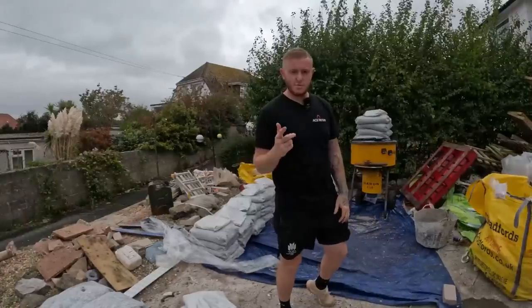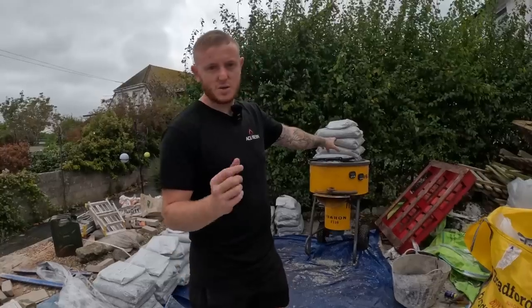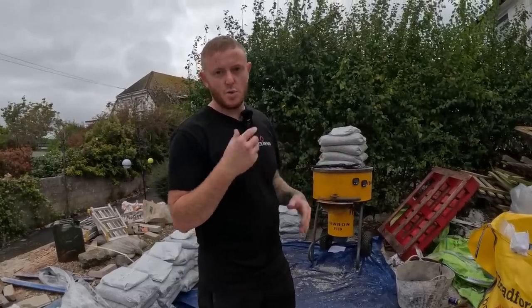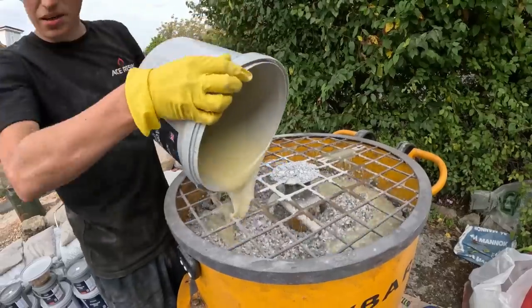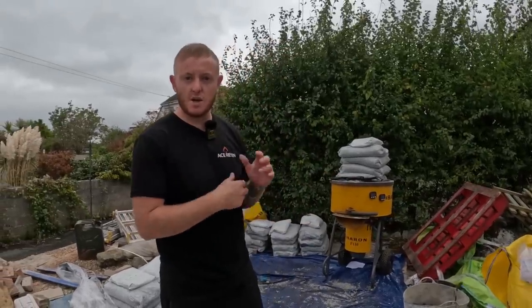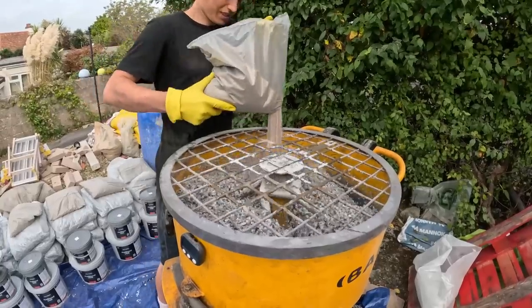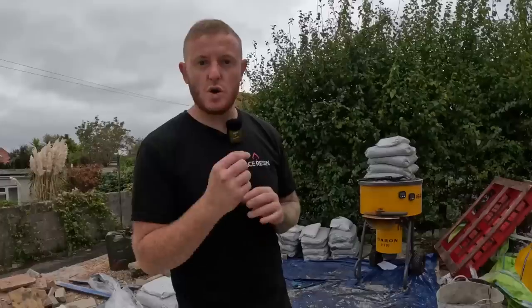So when it comes to preparation, again, we have two stopwatches, magnetic, so they attach to the mixer. So you've got one that's set at a minute for the mixing of the two-part resin, and then the other one is for 3 minutes, so when the mixture's actually going around, once the resin's poured in, and then again, the one that's set for a minute will do for another minute, so then when he pours the sand in, at the very end, it's mixing for 1 minute. So you've got a 1, 3, and 1 mixture.